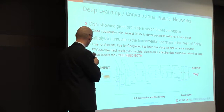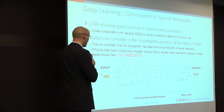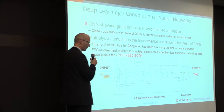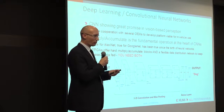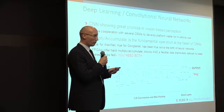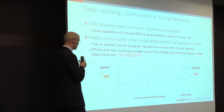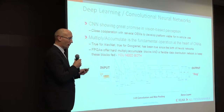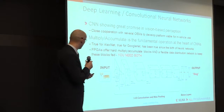The interesting part there is that it basically consists of two parts. One, you need to decide on a specific network, AlexNet, GoogleNet, whatever. But no one in the industry has yet found out which would be the right network to use for an automated driving or ADAS application. So we're currently evaluating different networks. We have some first results, also comparing to other semiconductor suppliers, which pretty much determine for us that we're on the right track and that FPGA architecture is very well suited.